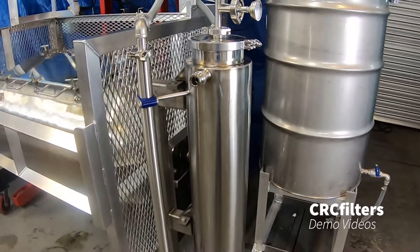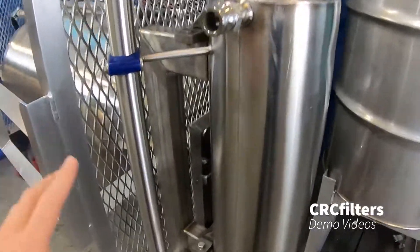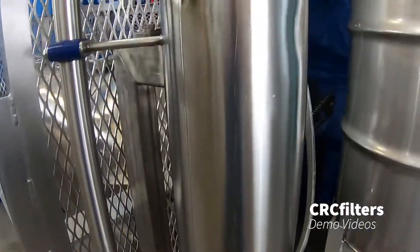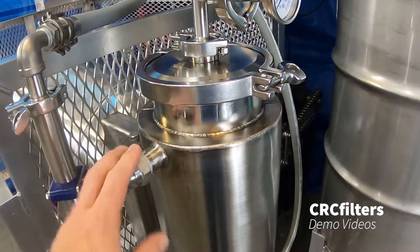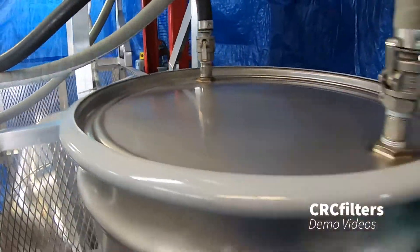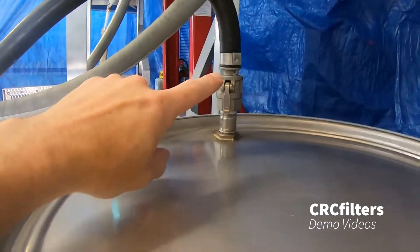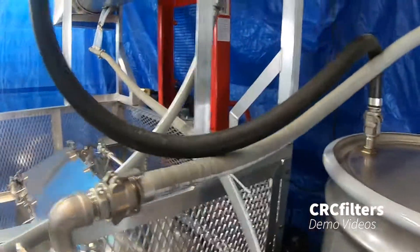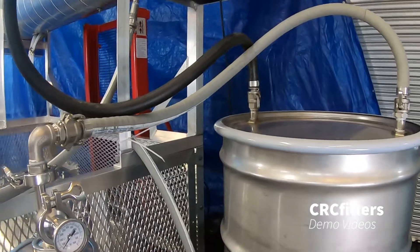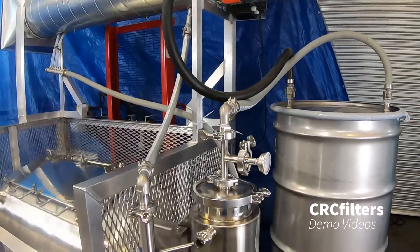Similar to CRC filter systems, everything here is gravity-fed — no extra pumps. The liquid travels down through a 3A molecular sieve column here, which is a jacketed column for R&D purposes, but the jacket isn't connected. The fluid fills the column and continues into our standard 55-gallon collection drum, which is also vented. The vent leads back up to the exhaust system so any vapor or off-gassing from the stored alcohol gets exhausted outside. That's the basic rundown.